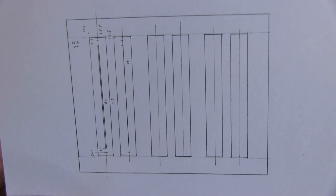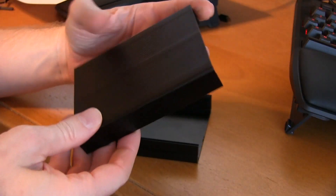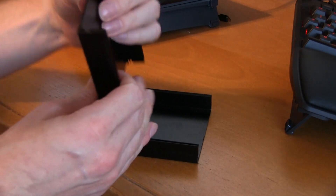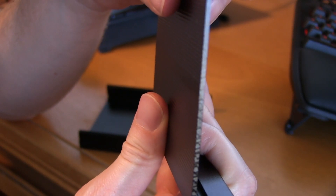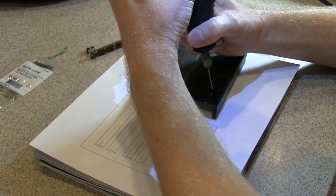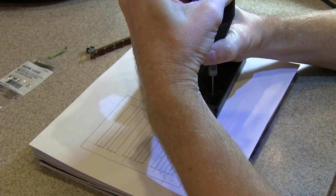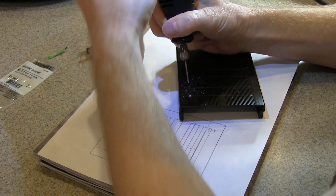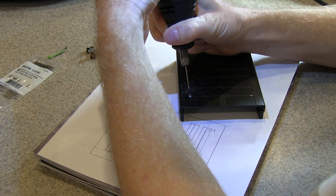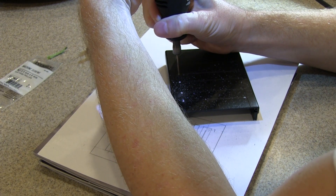When it's all done you won't really be able to tell on the outside. Here's a simple sketch to measure out and draw the cutting lines for the box — I'm going to draw those same lines on top, then use a Dremel to cut them. It's kind of thick aluminum so it won't be an easy task. Here I'm just drilling holes where I mount each of the slide pots to the case, since I have to cut slots for the sliders anyway.